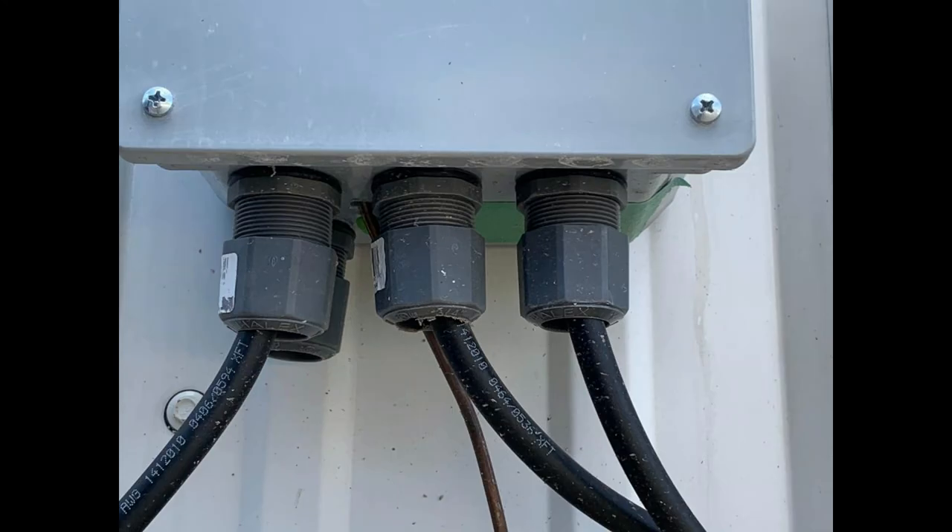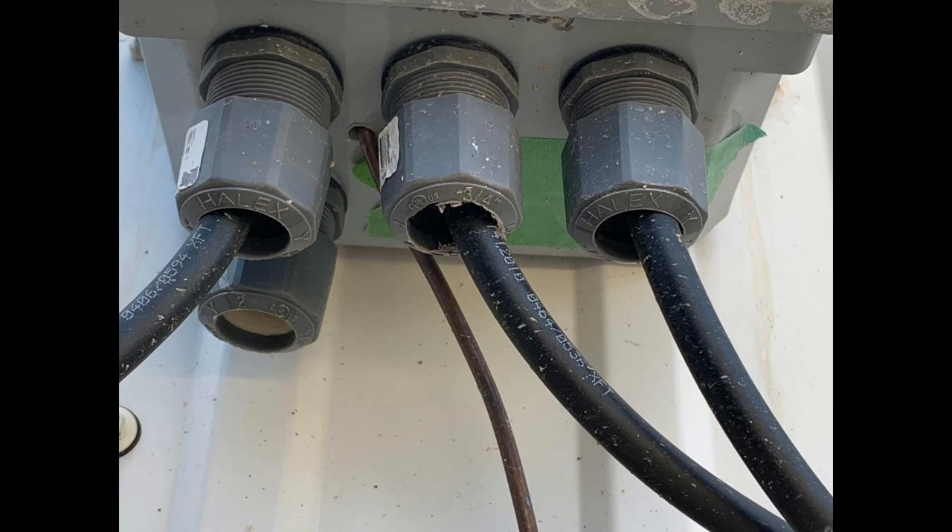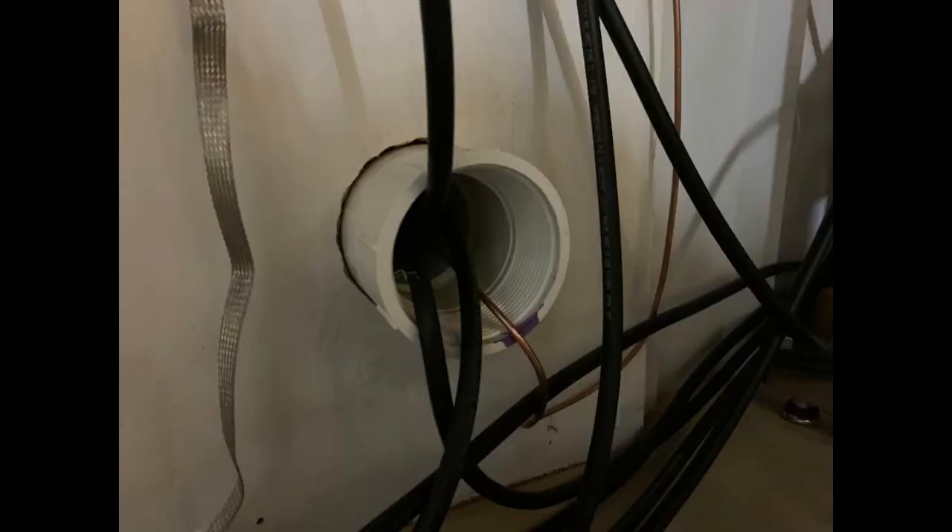This is our little box where we actually bring the cables in through the bottom. We bought conduit or CGB fittings large enough that we could actually run the entire PL-259 connector through, and then just shoved rags in there to keep the moisture and bugs out. Each one has a spare, and the ground rod goes through it too. Drilling the hole with a hole saw in metal was really tricky, but we got it done with our neighbor's help. From afar you can see this is where everything came in together — it doesn't look too pretty, but it gets the job done and we didn't have to cut any coax.